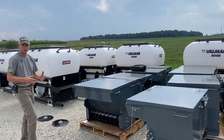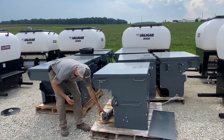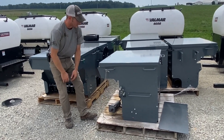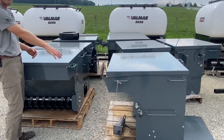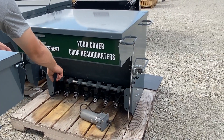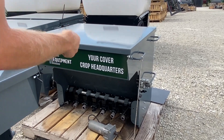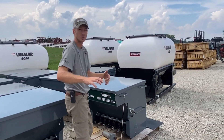These are a real handy way to get your cover crop seeded without an additional pass. The meter is controlled with an electric motor. If you want to come in here and look at the metering units, we've got metering cups right in there and each one of those is turning to meter the seed and distribute that out across your corn head.